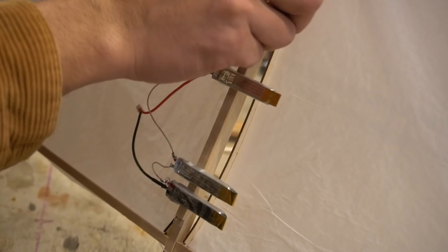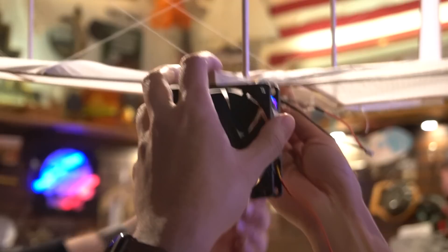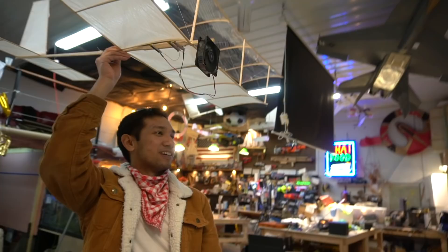I made this cool battery tray, which is basically a piece of balsa wood with batteries literally stuck to it. I have these little one-cell 220 milliamp-hour batteries wired in series to make a three-cell lithium polymer battery. I'm gonna take the fan and tape it on there because I literally have no better options right now. We have the fan just taped onto the front of it. You can't really hear it — you can only hear the fish tank — because at least these PC fans are whisper quiet.